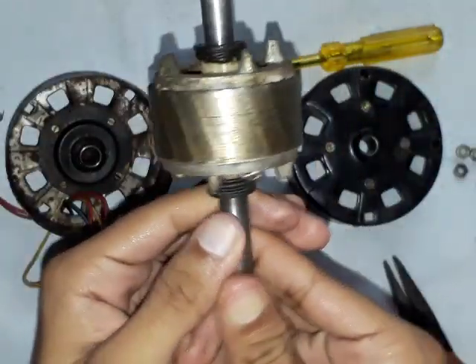I hope it is clear to all. Let's keep this aside and now let's focus on the stator. This is the stator. It consists of two windings — one is the main winding and the other one is the auxiliary winding. These two windings play a very important role in creating a phase shift, and that phase shift is created with the help of a capacitor. Phase shift is required to generate a rotating magnetic field.